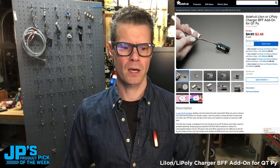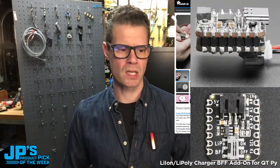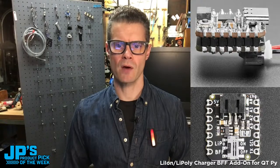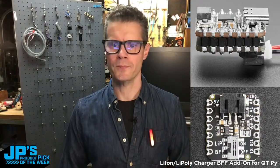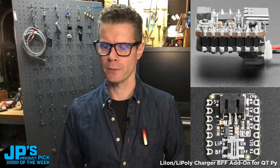Let's see, any other questions? I think that's going to do it. Yeah, so head on over here to pick some up. And you can use these in a lot of different microcontroller projects, particularly these beauties right here. Actually, that's a nice shot you can see on the top there of the standard header pins that it comes with, and you just snap those off and solder. I think it's 7 on each side, and that makes the connections that you need to make. And also, since it has the castellated pads, you can do some sneaky things which still leave some holes open.